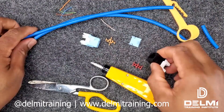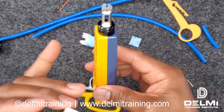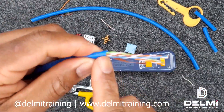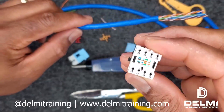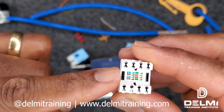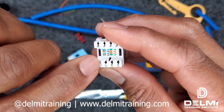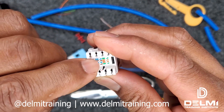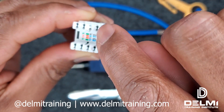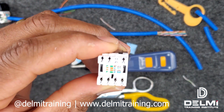The next jack that I'm going to be terminating is the Cat6 Plus. This punch-down jack requires the use of your 110 impact tool. I'm going to insert my cable, then take off my cable divider. This Belden jack allows you to terminate in the 568A and 568B pinout termination — this termination is going to be the 568A. So my solid blue from this jack is going to go here, my white blue to the next one, my solid green into the third groove and my white green to the fourth groove. On this side, my solid brown is going to go here, my white brown over there, my solid orange and my white orange.